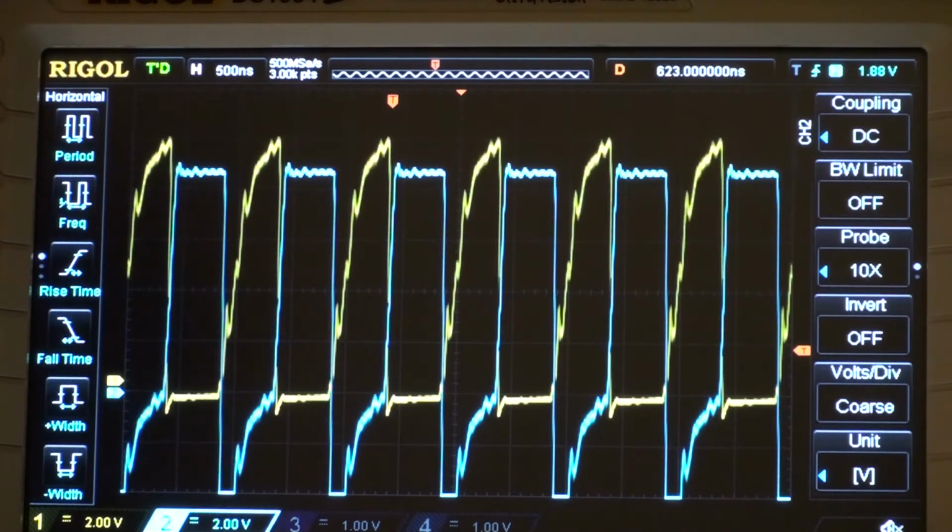So I'm actually surprised that this 1N4007 has about twice as good reverse recovery time as the UF4007. That in its datasheet practically states that it's better than a 1N4007 on reverse recovery time, because both have the same current carrying capability, they have the same voltage or reverse breakdown voltage, both of those are the same, and the only real difference between them is the reverse recovery time, where the UF4007 should be better, but it isn't. So yeah.